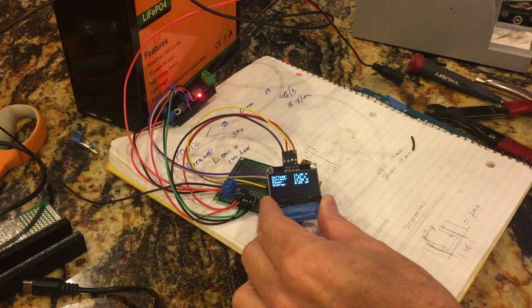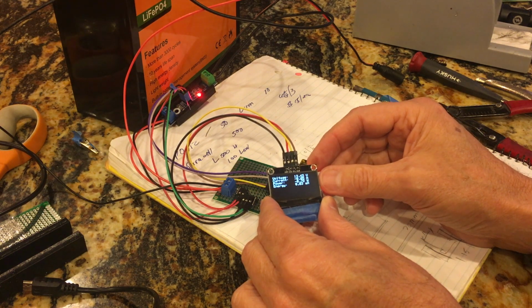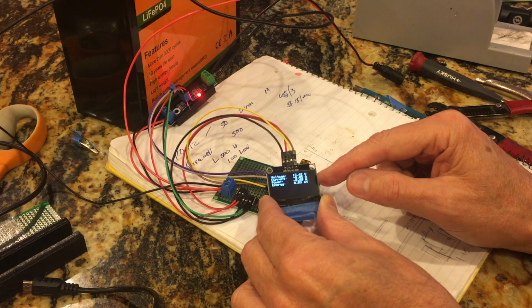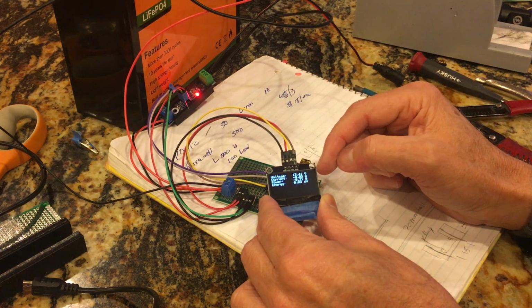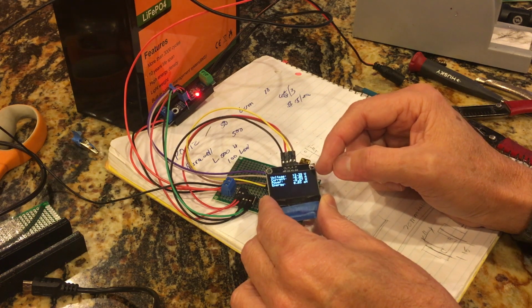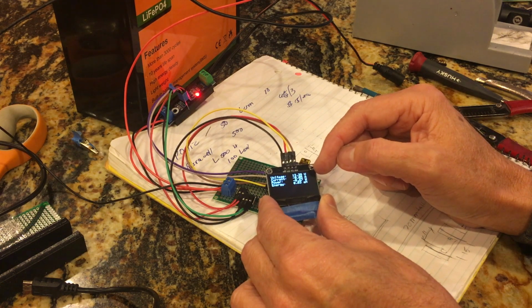And then if we disconnect that, we're going to show that very tiny offset error, that 0.05 amps, which is incorrect. That should be 0. A way to upgrade this would be to put in a precision voltage reference, maybe a high value, a precision voltage regulator, and then instead of using the 5 volts from the Arduino, because I measured it, and it's 4.991, and that slight error in the thousands is enough to throw this off, so it thinks it's discharging.